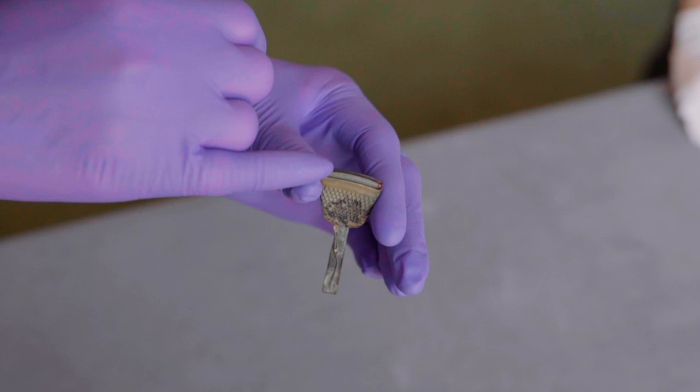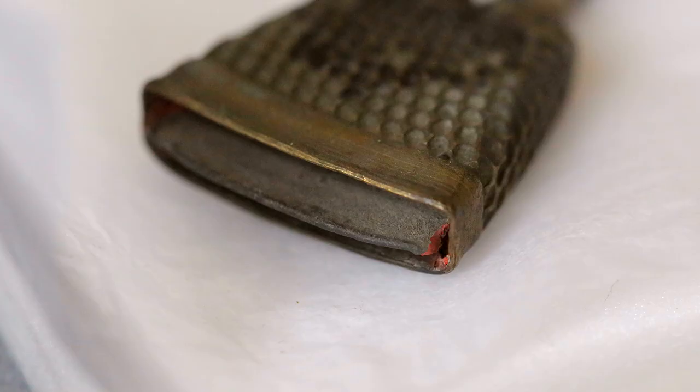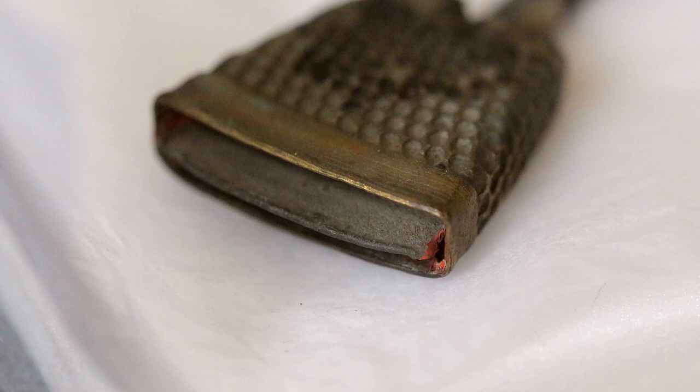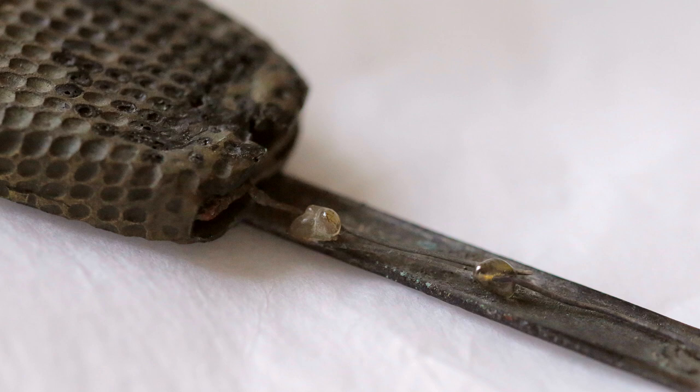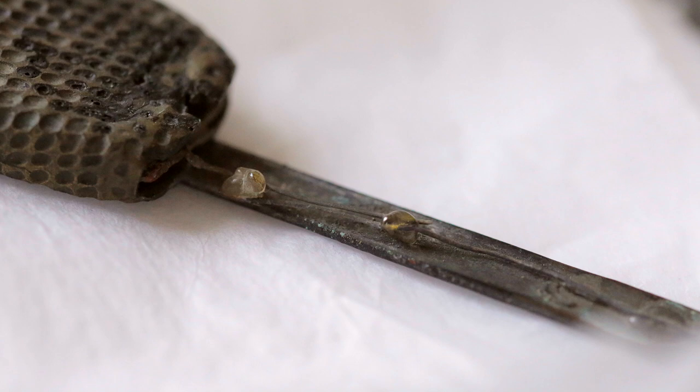You have a plate of zinc in the middle and if you put some mild acid in there — some sulphuric acid — you begin to get a wet battery. It will generate a little bit of current for you, and you can see the plate is connected on the outside to a couple of wires which have been soldered onto the stem here. There are a couple of borax beads which just keep the two wires apart.